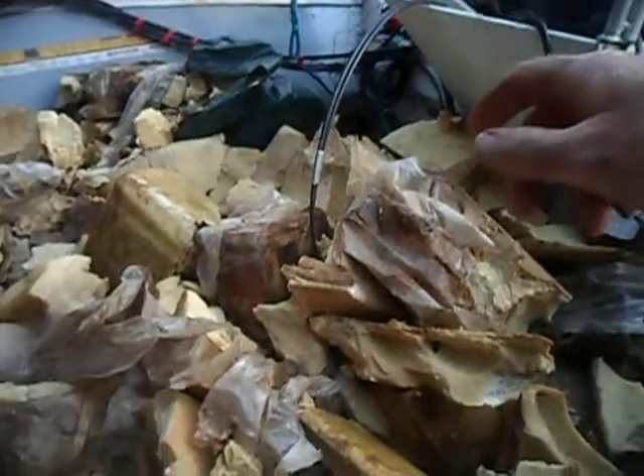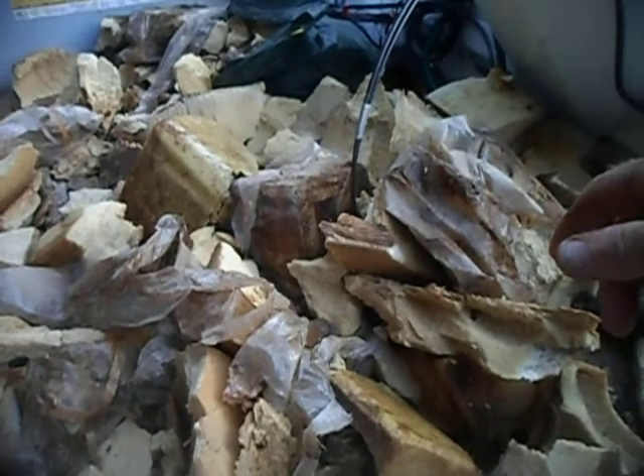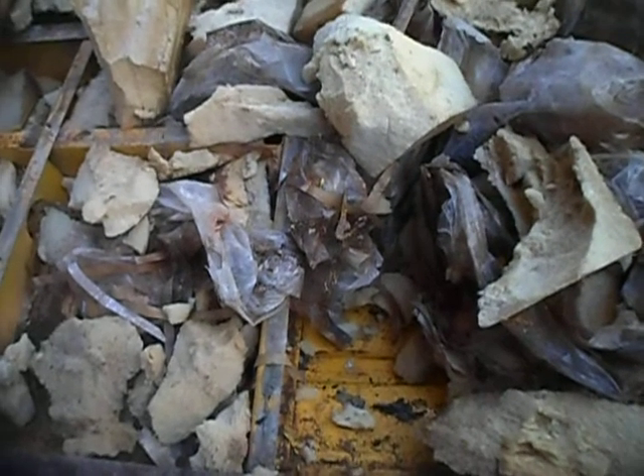So it's a good chance to get rid of it all before I put the new floor in, and then I can put the two-part flotation material back into those compartments with some plastic lining. In the meantime it's a good chance to inspect the bottom of the boat. A lot of it's in really good condition, but some of the paintwork has broken down with a lot of sand and loose paint there. So I'll go through all that, seal all those rivets, and give it a coat of epoxy, then redo the flotation before I put the new flooring in.